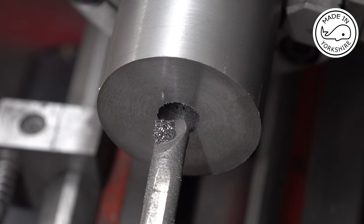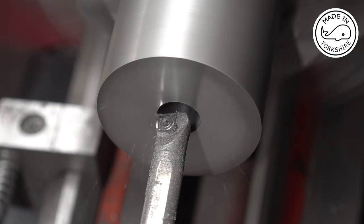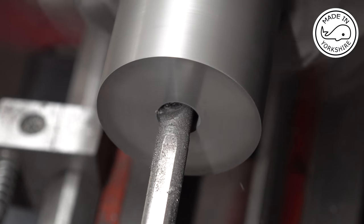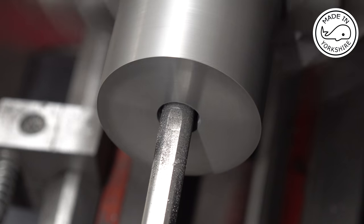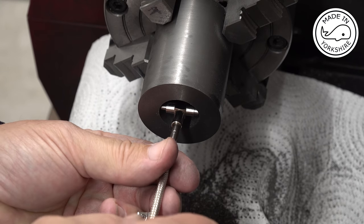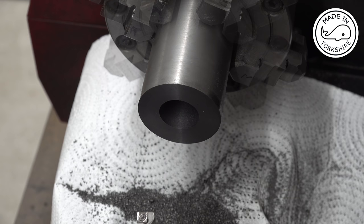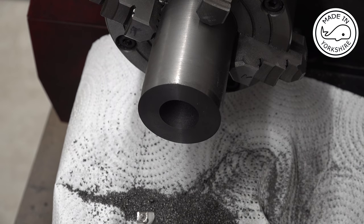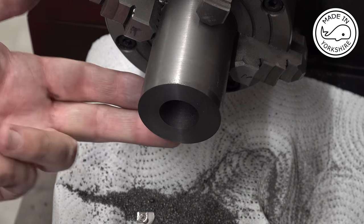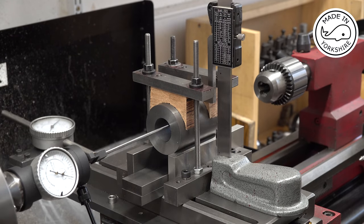Okay so I've got it up to 13mm with a normal drill bit and now I'm going to use this boring bar. That comes in at 40 thou under my target and I've decided I'm going to use the between-centre boring to get the final or close to the final dimension. I'll repeat the same process on the other cylinder off camera. It must have taken me over 2 hours trying to get this set up right for the between-centre boring.